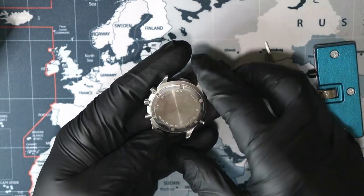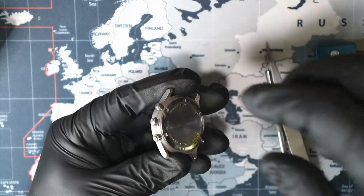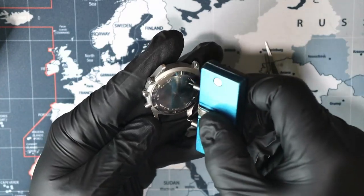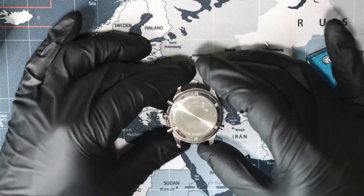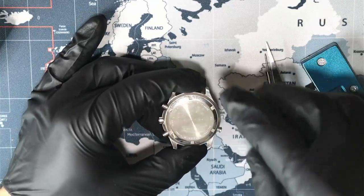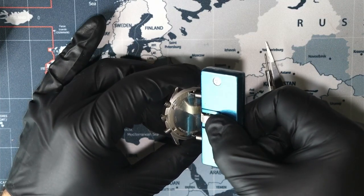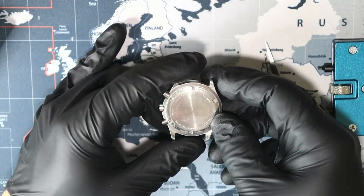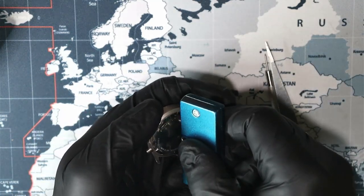Most watchmakers that I see on YouTube, they just use a big rubber ball — they're inflatable, specifically made for this. You push the rubber ball against the back and then you have enough friction to actually open it. Or they have a tool that almost looks like a little press — you put the case in, it gets secured in like a type of vise, and then they have the same two or three prong setup that fits into the case back, and a little crank wheel that cranks the back loose. We have to do it the handheld way here.